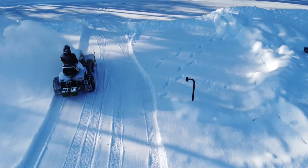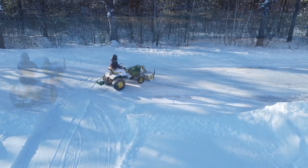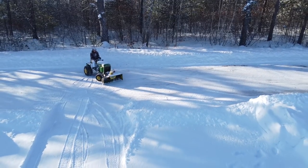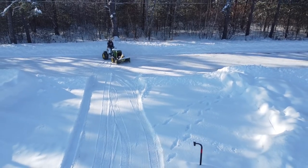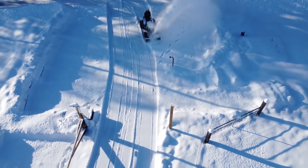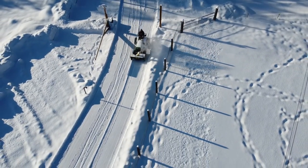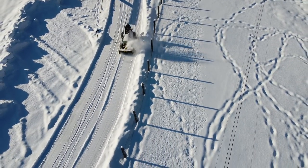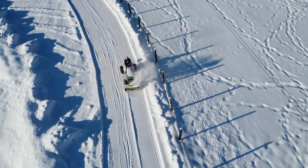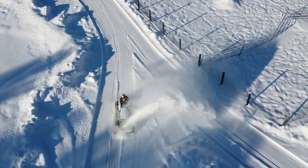What I like to do, since I don't have to go to a 9-to-5 job, is I wait until it gets colder. Hypothetically, say it's 32 degrees and you have 6 inches of wet snow — you can either go snow throw it right away and deal with that wet snow, or you can wait until the temperatures drop and snow throw either in the evening or the very next morning. When the temperatures drop, the snow solidifies, it's no longer sticky, and it will blow like crazy. In this video of the John Deere 400, it snowed the night before and was wet and slushy, but once I waited until the next morning at about 6:37 AM, that snow was perfect and it threw with no problem.